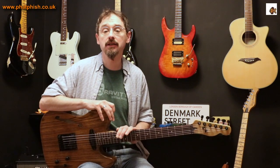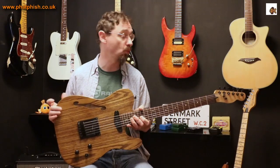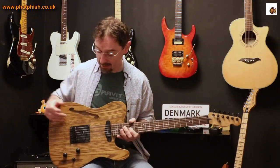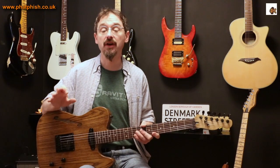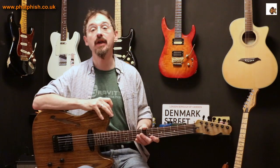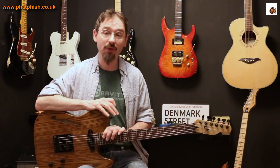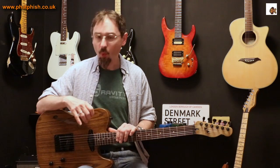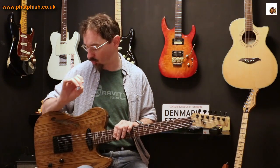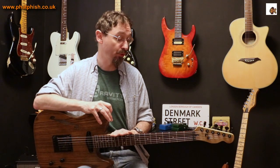Basically he's got a set in his guitar and he's having some problems with a bit of noise. Now Seymour Duncan Hot Rail for Tele pickups I am very familiar with — they're what I have fitted in this guitar, the one I've built myself: an ash-bodied thinline Tele. When you buy those pickups they should come with a wiring diagram. If you haven't got that, it's freely available from the Seymour Duncan website — I'll put a link in the description. The wiring diagrams are pretty easy to follow. If you're handy with a soldering iron and confident, it's not a difficult thing to do. The wire coming out of these pickups can be a little fiddly because there are five cores to it, but if you take your time you should be okay. If you're not confident, a guitar technician at your local guitar store should be able to do the job for you.